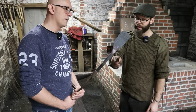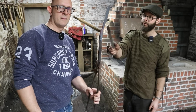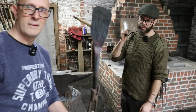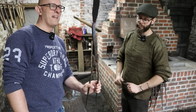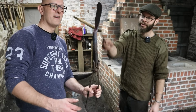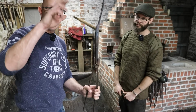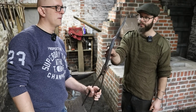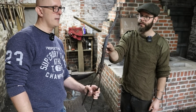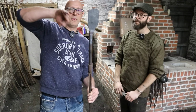And then just tidying up the transition areas here. So as you start to roll it up, things get neater. You could roll that up and it would look like a dog's dinner. I can't let it leave my forge like that. So we'll just tidy things up now. This is essentially going to be the junction between the blade and the socket. So we want more width here to bring the shoulders out a tiny bit more. And in that process, things will open up anyway. So these edges want to be more bowed out.